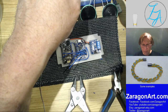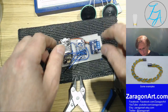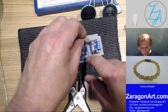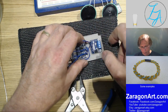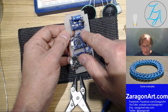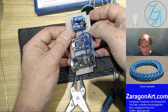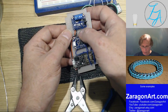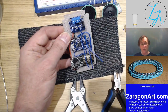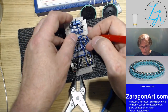And that white connection there is also a minus. So the ground connections go to the minus. I've got to get them the right way around, because if I get it wrong, it bridges the two sides together, and that could cause the amplifier chip to basically overload and blow up. Not blow up physically, but blow up as in let the magic smoke out. I don't want to let the magic smoke out.